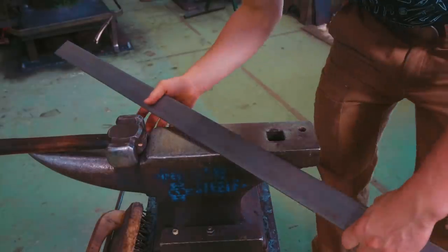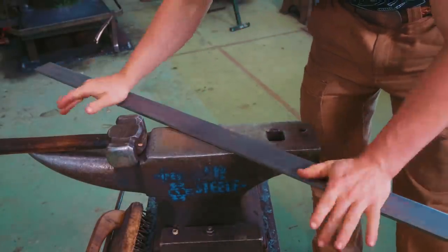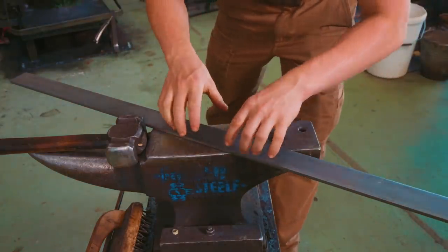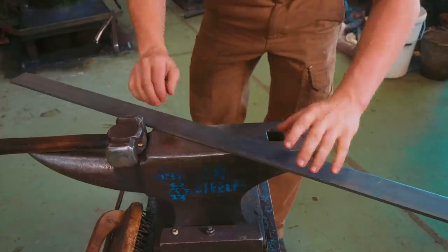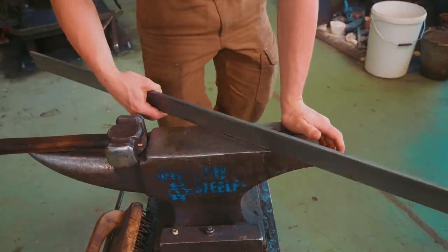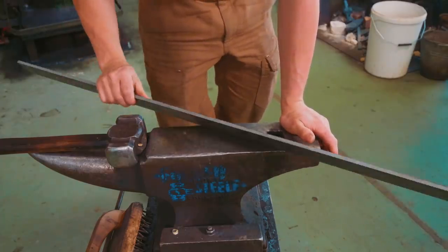But this is the only steel that I have that would be suitable for it. This is some 1095. So obviously this wouldn't usually want to be a sword steel, but with a hamon, which is creating a very much different structure in the blade because you have unhardened material and hardened material, it would probably make it fine. The downside is, this is only 2 inches by 5/16 of an inch thick or so. It's about 50 mil by 8 or 9 or 10 mil.